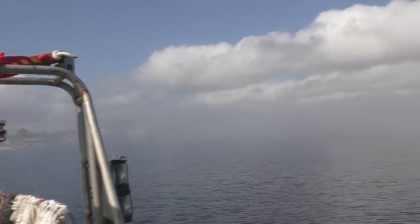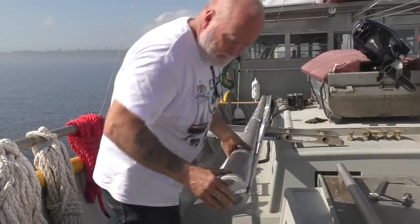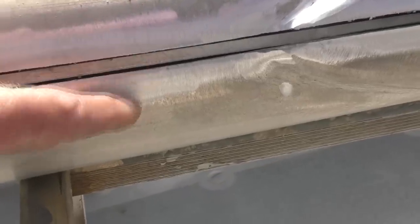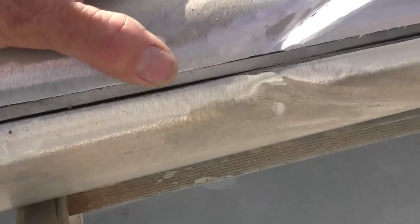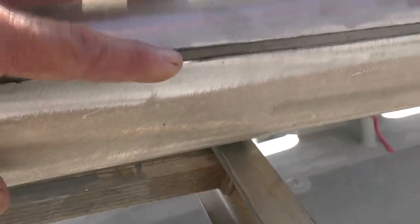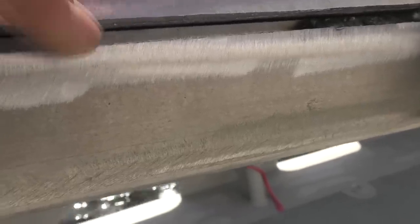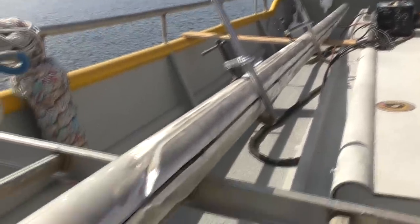It's almost noon - the fog's finally burning off and I'm ready to tack the other half on. I could weld that plate in the center to the bottom half all the way down and then put the top half on. That would leave me an easier weld down inside where I've got the doubler. It's important to connect the top edge of that plate in there as well. I'm going to roll this thing over so I can weld flat down into it.